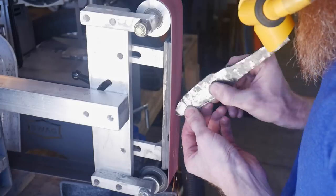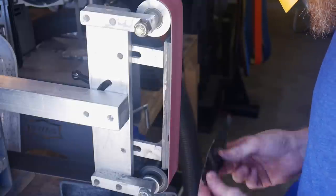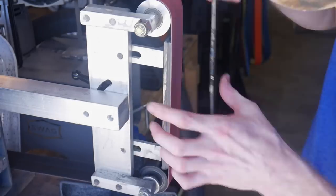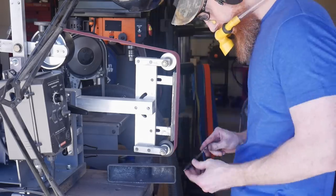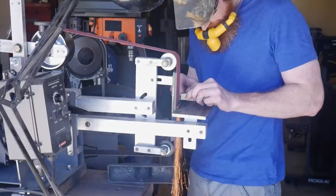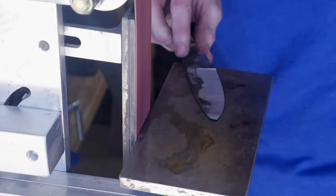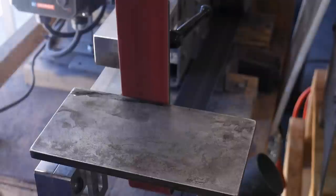This blade steel is 1084, and I started off with a quarter-inch by one-inch wide piece. Now we're getting the rough profile put into this knife. Before I surface ground it, I wanted to profile it a little bit on a worn ceramic belt and also maybe rough in the bevels just slightly. I'm practicing this work rest push stick grinding technique that I saw a bunch of really good knifemakers using, including Travis Wurtz who manufactures the TW-90 grinder, and Nick Wheeler.